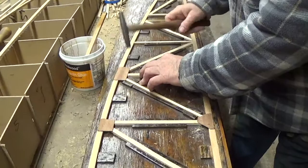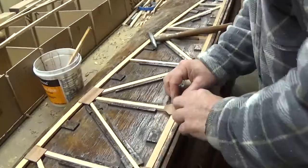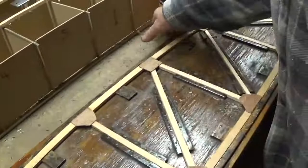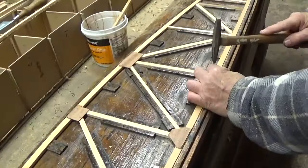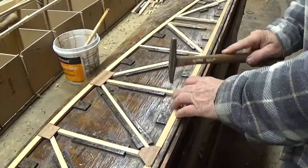You can see when I pick up nails how I choose to find them that are out by themselves. You only want to pick up one nail, otherwise it takes time to mess around trying to get the other one away from it so you can use it. And then you can spread them out a little bit, it doesn't hurt. These are just tips that you've picked up over the years from doing it a number of different ways and discovering what was easiest. It's the fastest, simplest way I know to build a rib.